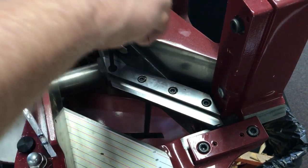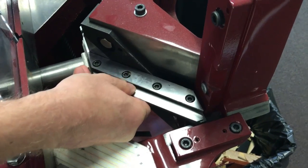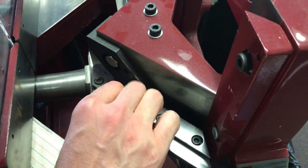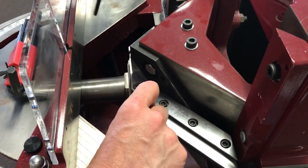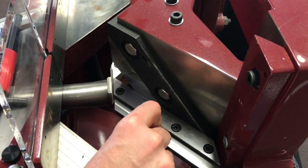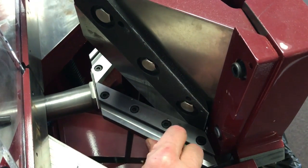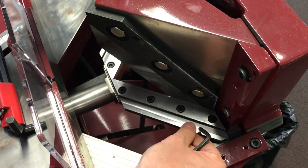What we can then do on each side is — you might want to start at the front — loosen off the blade and push it all the way in to close that gap at the front meaty part of the blade, right on the meat, and tighten that up. Then lift up to the next part of the meat of the blade, push it in and tighten that screw. Then lift up to the next part and push the back part of the under knife in and tighten this up, and then finally towards the back.